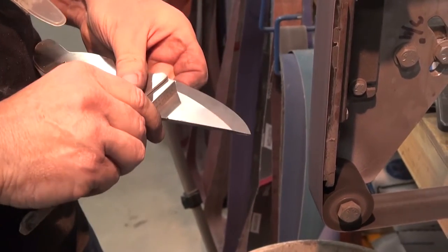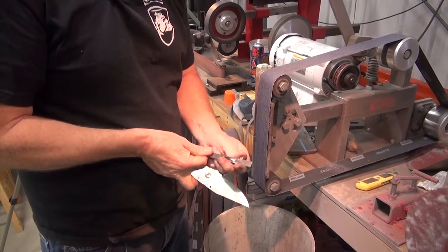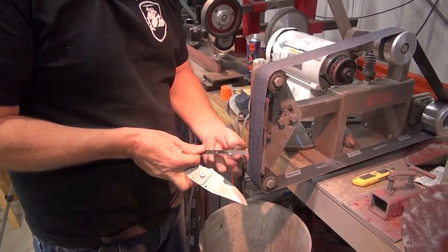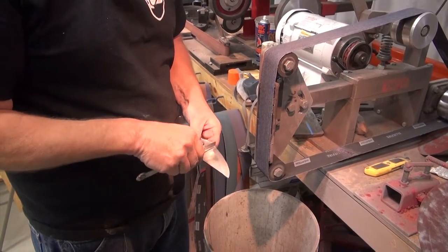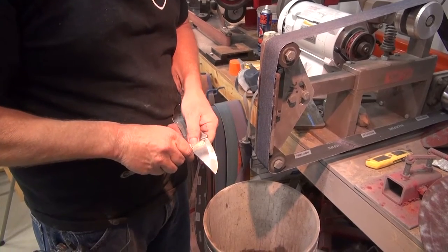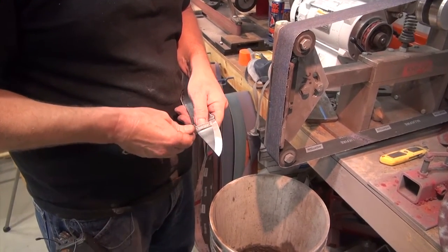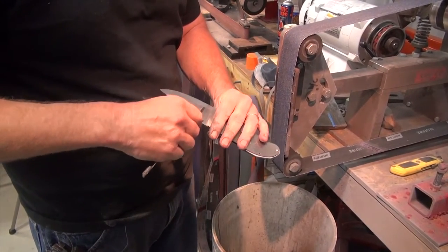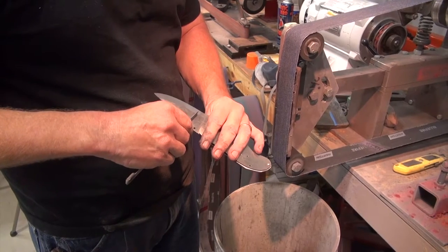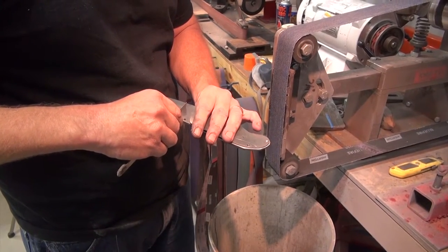Doesn't take long for this thin a blade. There's this little gadget here, and it moves all around, so you just got to measure off one side. So what I'll do is, just above the plunge, I'll pick a spot where it kind of goes flat, and I'll measure the height there, bring it over and use the same side, and I'll measure the height right there, and I'm within just a couple thou.